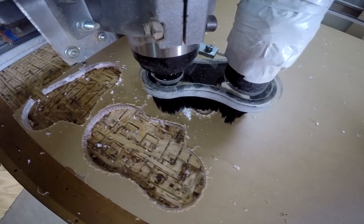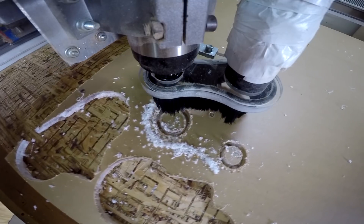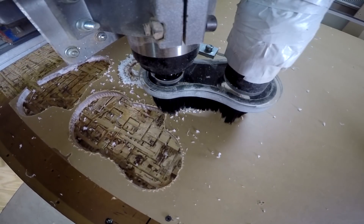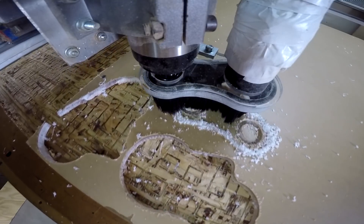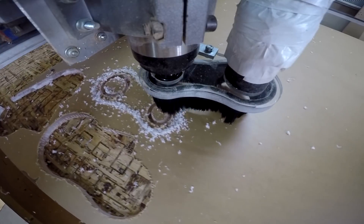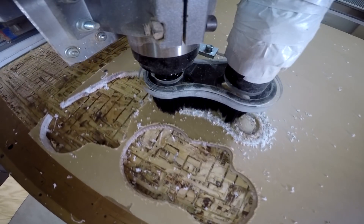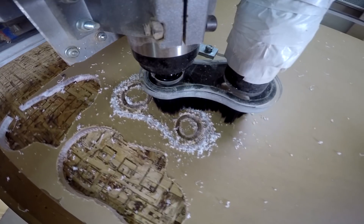On this portion we are doing the pocketing for the brush strip, going up to about a quarter-inch depth. Notice the difference in appearance of the chips being left behind — on an initial pass there's really no place for chips to go. With acrylic the chips get sticky and stick to the edges; this is common with thermoplastics. The pocketing width is about 0.28 inches and we have to make sure the strip brush can fit into that groove.